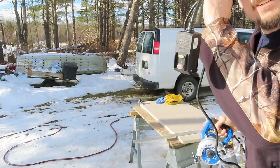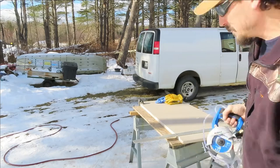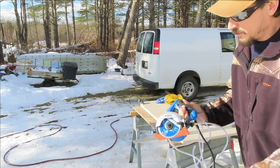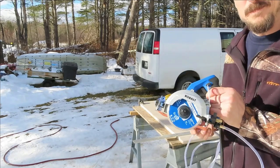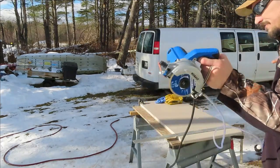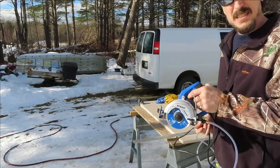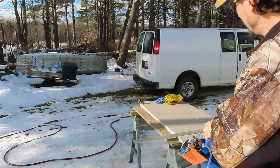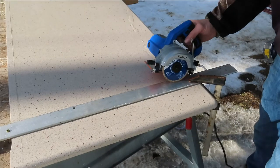It has a built-in GFCI, so we are dealing with water and electricity — that's a good thing. If you use just a regular cutting disc on a skill saw, make sure you have a GFCI built into the wall or in your extension cord. We're going to get this all hooked up to water and zoom in and cut that countertop right there.